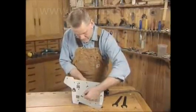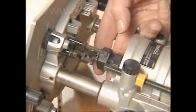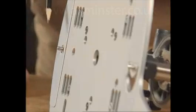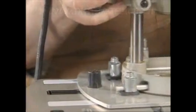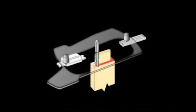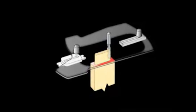Once the guide has been chosen and snapped into place, the matching diameter bit is installed in the router. The two guide pins on the bottom of the sub-base guide the router. The right-hand guide pin slides in the right slide track, and the left-hand pin circles the guide creating the shape of the tenon. This animation shows how the guides and guide pins precisely steer the tenon bit.